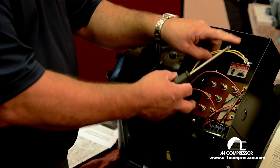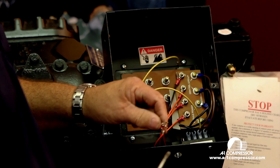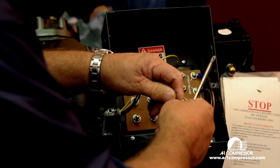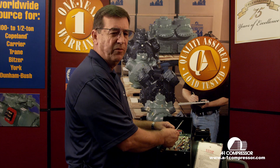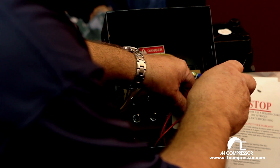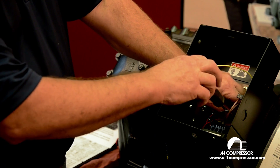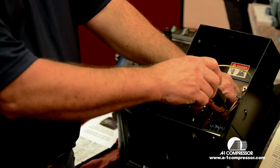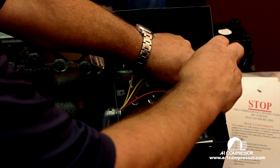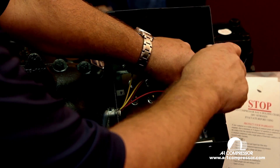The red ones are going to be our module power. It doesn't matter whether they're 110 or 230 volts — it depends on whether you're running it on a 230-volt system or a 460-volt — but you want to supply the power to the module constantly, all the time. Any time the power is broken from the module, it will have an automatic two-minute delay built into that.